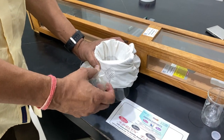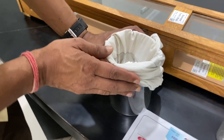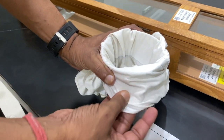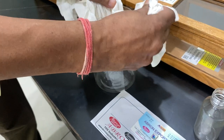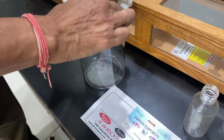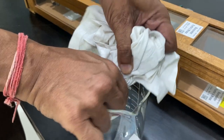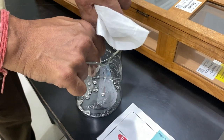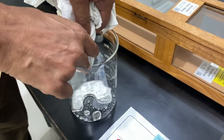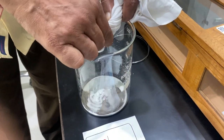The mercury comes in this bottle to you. This is for cleaning. I have taken a 1000 ml glass beaker and put a double-layered handkerchief, and then you have to very carefully lift it. This is only for cleaning if you want to fill in the barometer. We are cleaning it and then sending you. Just rotating — just see how I show it from the top. This beaker is going and then I am rotating the top so that it is just pushing out of the cotton cloth. You can see it is coming out — I am just rotating.